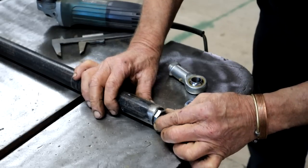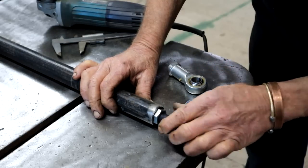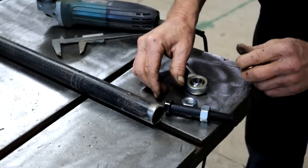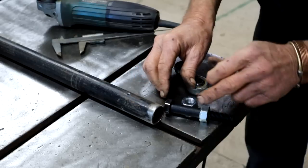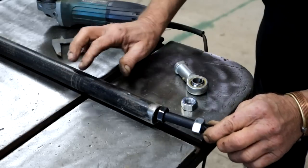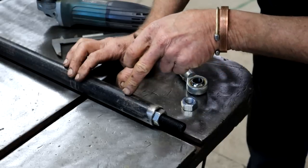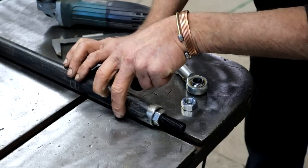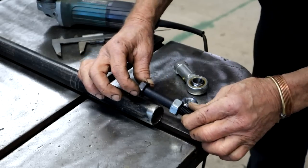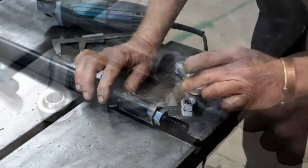If I knock the corners off that nut, it'll also slide in. So I've got this plan to position this nut right there where the thread starts, and then weld it on. And then once it's welded on, I can stick this in, weld it here, and then I want to drill some holes there, and I can plug weld that bolt head so that we hold it on the bolt head as well, and right here on the end, like so.